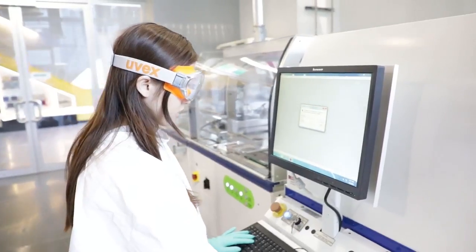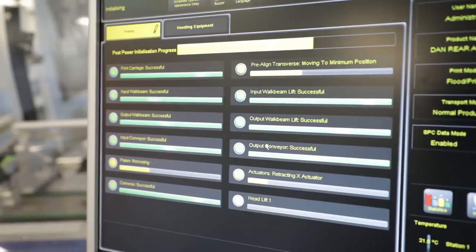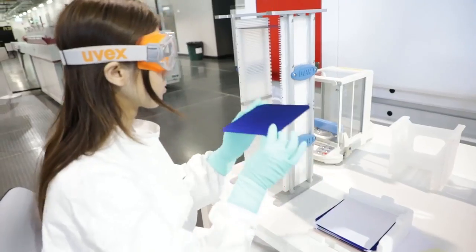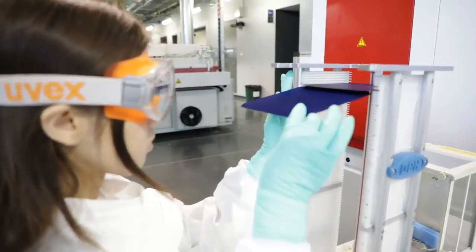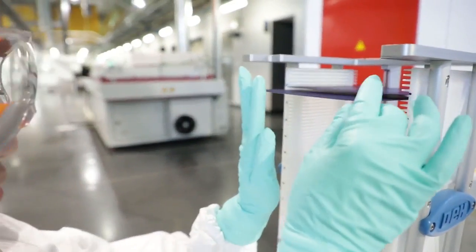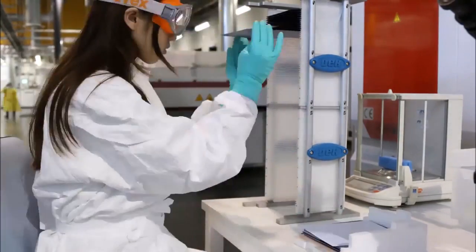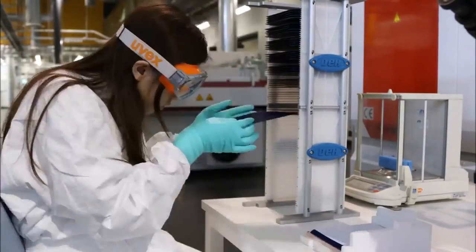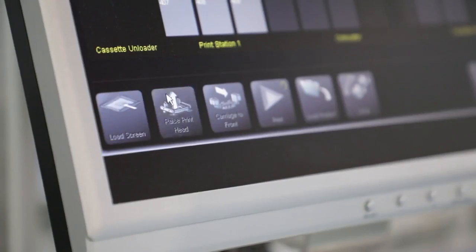The final step in standard solar cell manufacturing is the formation of contacts to collect the light generated carriers. The most commonly used method in the solar cell industry is screen printing. Cell precursors with a front side emitter and anti-reflection coating are loaded into a cassette for processing.